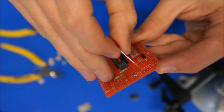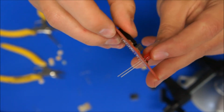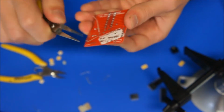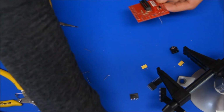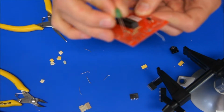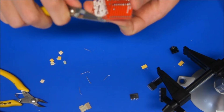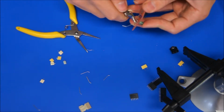So I go in here, drop it all the way down to the board. Oh sorry, all the way, don't sit it up like that because we're going to be stacking things on top, so all the way down to the bottom of the board, and bend those leads out, semi-clinching them the same as usual. I've lost my green LED, here it is. This one just goes in the different direction on this version of the board. Bend that out, just making sure the positive lead went into the positive side, and snip them off like usual.